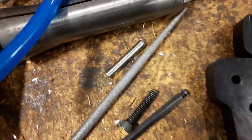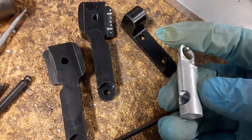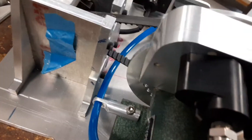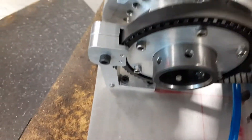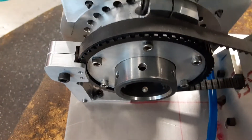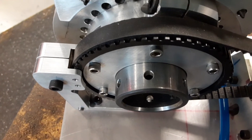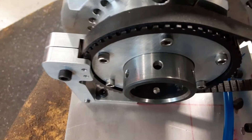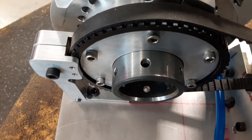That's about all I did. We want to make sure we make good quality parts. Usually when I'm running the job, I'm running in one direction all the time, and if I have to back it up, I make sure I back it up and then move it forward to go in the same direction I was moving — I would reverse to do something but make sure I go forward again.